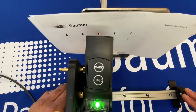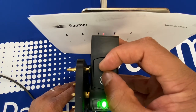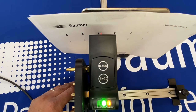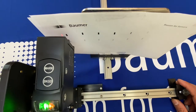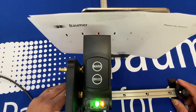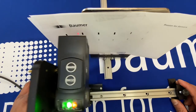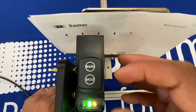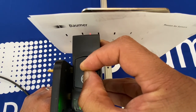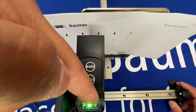To activate the delay setting, press and hold the mark and background buttons together for two seconds, and you can see that the third LED has now come on indicating it's activated. The output will come on and then delay coming off for 20 milliseconds. This is really only noticeable when working with very fast applications. To turn it off again, simply press and hold mark and background together again for a couple of seconds and the third red LED turns off.